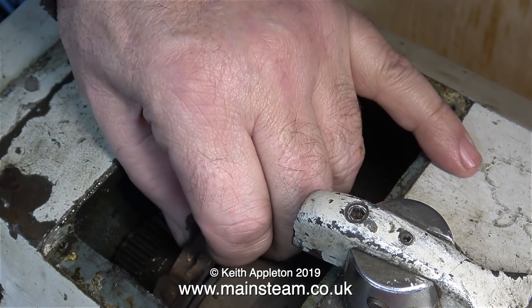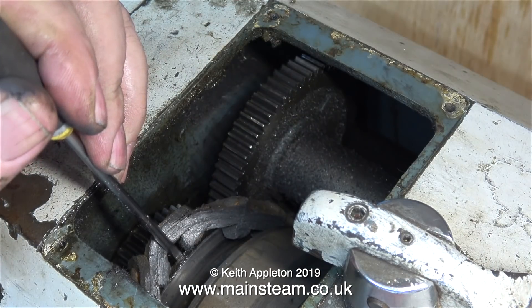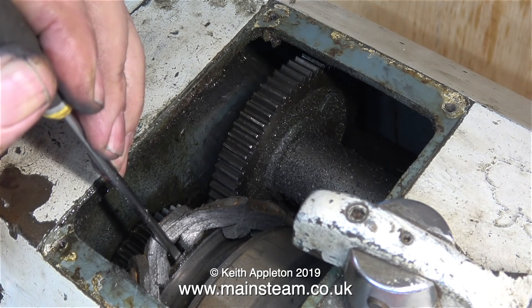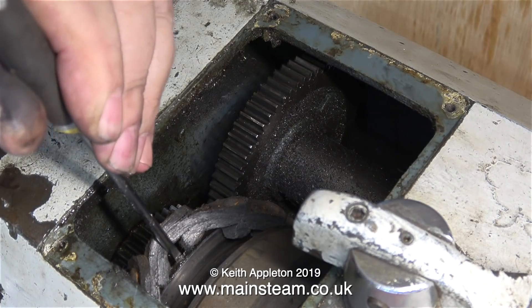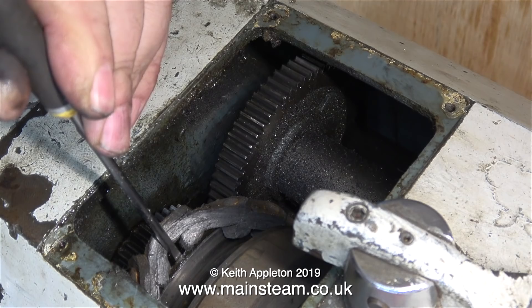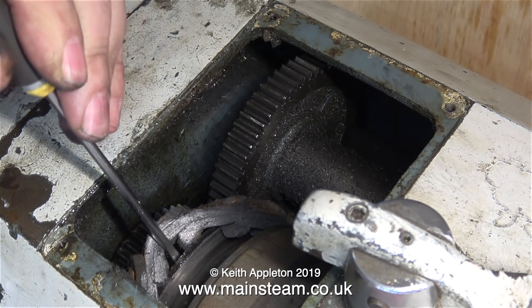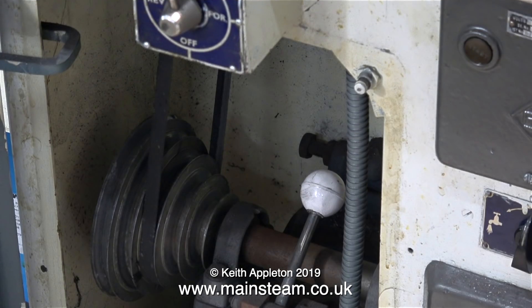I think I know what the problem is. The problem is me. When I was fixing the three-phase converter I repacked the lubricating cups on the front of the headstock with some new grease, and I think I packed the cups too many times. Once is sufficient — three times is excessive — and some of the grease has found its way onto this pulley. The solution is I need to clean it off. First of all I wiped the belt with a cloth. You can't see this because it was impossible to video — it involved me laying on the floor again with my arms up inside the cupboard with a cloth to wipe the belt.